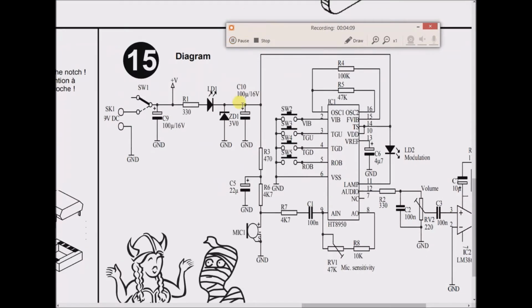I don't want to say too much and get it wrong, but it looks like they create a type of voltage regulator at the beginning to create a power supply. They're saying 9 volts DC in, but then to me the Zener diode shows, was that avalanche or forward breakover voltage, that I guess keeps the voltage capped at 3 volts. Something like that. So now I might be able to do something like that.